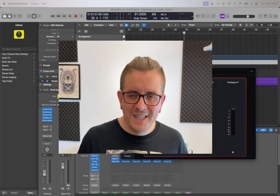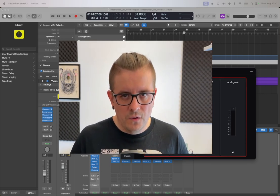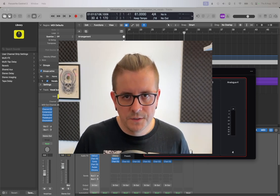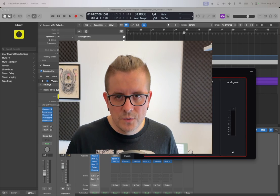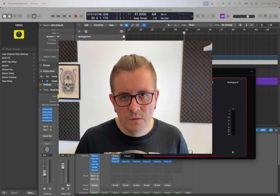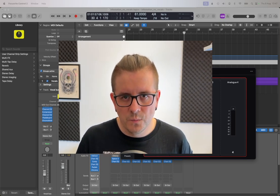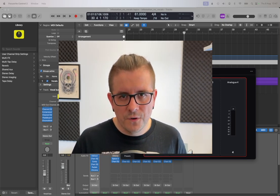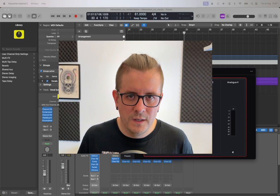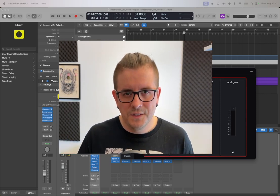An optional thing you can get alongside the audio interface is a preamp in the form of a Cloudlifter or a Fathead, which takes your microphone signal and boosts it up a couple of decibels. A lot of USB interfaces have gain controls, but using that gain control can introduce a lot of noise. A Cloudlifter or Fathead won't introduce as much noise. I'm using a Scarlett 4i4 4th gen which doesn't really need this kind of preamp, but a lot of interfaces do — especially to power microphones like the SM7B.